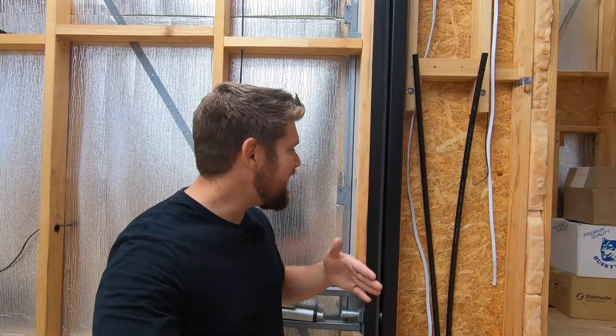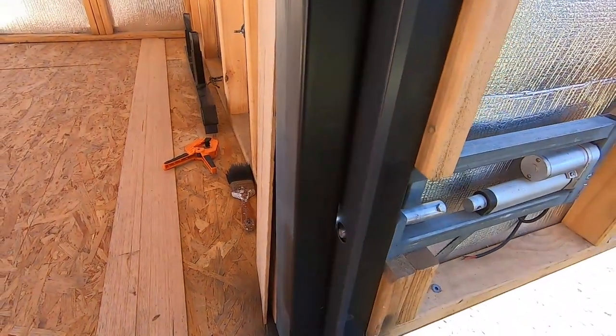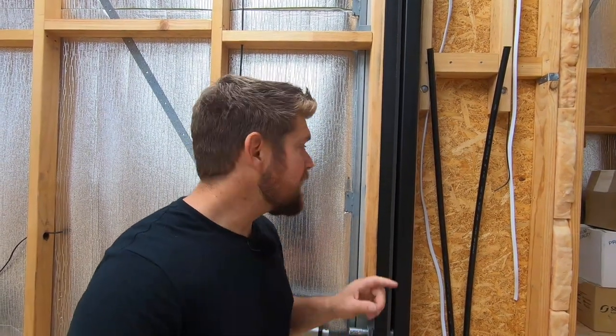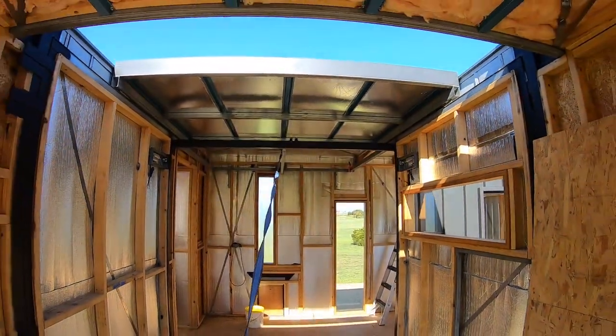When the walls swing around and nest into the side trailer, there's a large overlap that makes the walls weatherproof — I go into more detail about that in the previous video. The important thing to note is the gap between the frame on the side trailer and the end of my swinging wall. This is what allows my trailer to be a little bit out of square, with the walls either closer or further from the side trailer. In fact, there's a larger gap on one side than the other because the trailer is probably slightly out of square. It also allows the two trailers to move a little independently as the house settles or moves in wind, and the locking pins are housed in nylon bushes so they can move freely without making any noise.